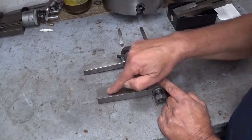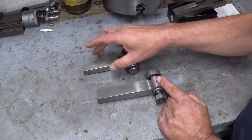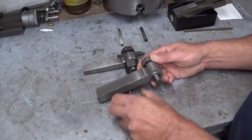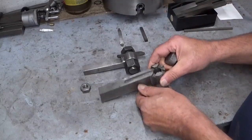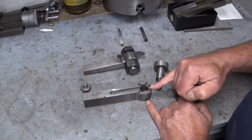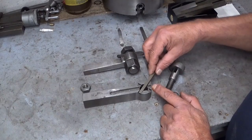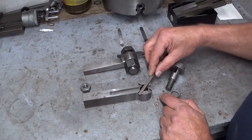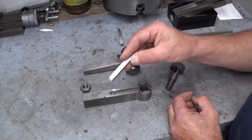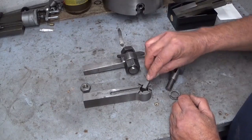So today's plan is a little bit multiple. First of all, make this shank more or less the same dimensions as this one. This one is perfectly fine. And if I take it apart here, in here I can put some pieces of high-speed steel, but I don't have the right dimensions. This one is too small. This is an 8mm square. This one could be perfect and it fits here, but not in the others.